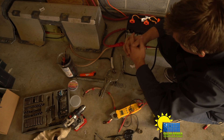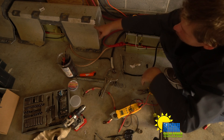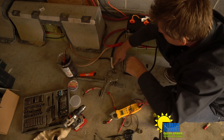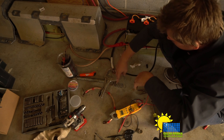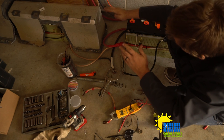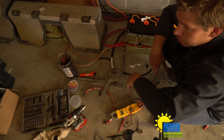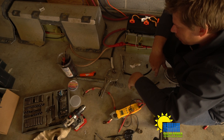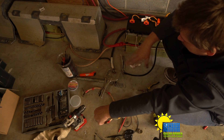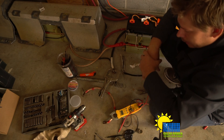Once they balance I'll be able to connect both circuits, which will be cold to the touch. Right now we're also charging through this big fat wire into the battery with the lowest voltage and least resistance. The charge controller is hooked up here and charges that side, so we're charging and discharging these batteries simultaneously. There's a lot of power in there — this is going to take a long time, maybe three hours or more. Once it balances it'll stay balanced. I've got a lot of stuff to do today, and I'm also going to upload a video on wiring up this battery bank.